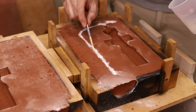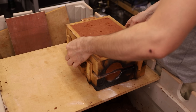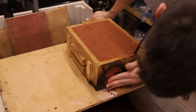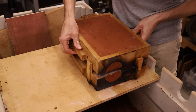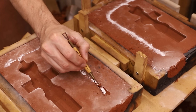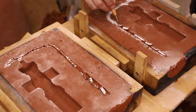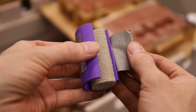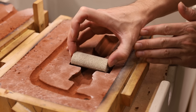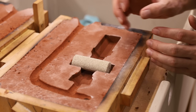I need to cut a sprue on each side of the mold in the exact same location, so I'm using baby powder as a way to transfer the location from one side to the other. And here's where that core comes in. I'll just leave it right here and the metal should flow around it, forming a hole that goes through the hammerhead.